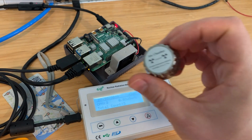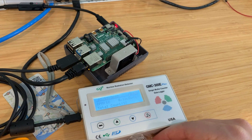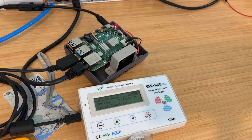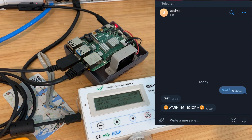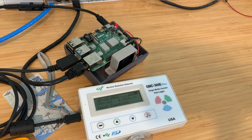I'll be using this ion chamber from a smoke detector to trigger the alert — this is just for demonstration purposes only, you should have no need to do it. Once the radiation reaches the preset value, we should start seeing the alerts in Telegram. The high radiation alerts are coming directly to my phone. The frequency of notifications depends on the notification cooldown variable in Docker Compose. You can read more about different variables in the GMC-300 block README. Be creative and stay safe.